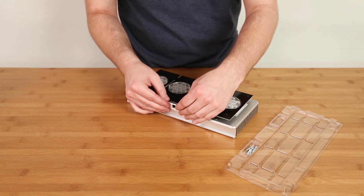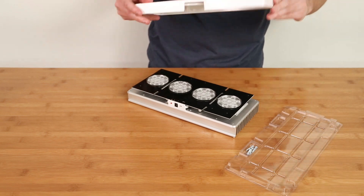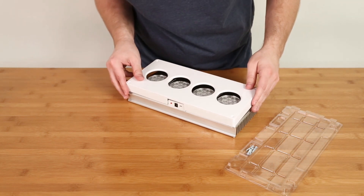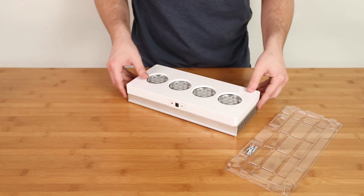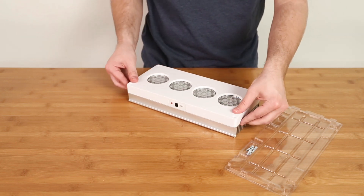Place the plastic cover onto the power connector and slide the plastic housing down, starting on the same side as the power connector. Using 10 lb·in, screw the plastic housing down using the T15 Torx tool and the supplied screws.